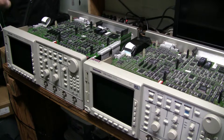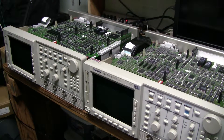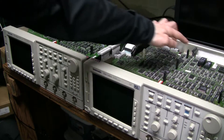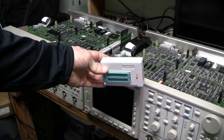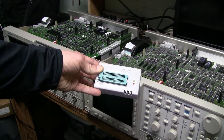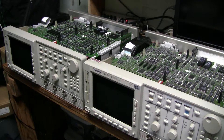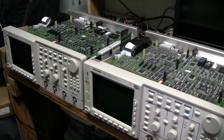So I tried putting this chip into this scope. I booted it up and sure enough, it showed the FFT option. So I decided to make a copy from this chip into this one, and I tried doing this using the same TL866CS programmer — and I failed. Everything appeared fine: the programming process finished fine, the verification finished fine. Then I put the copy into the scope, booted it up, and it appeared as if nothing had changed at all.